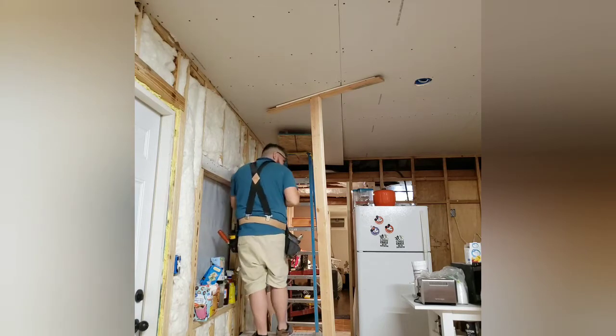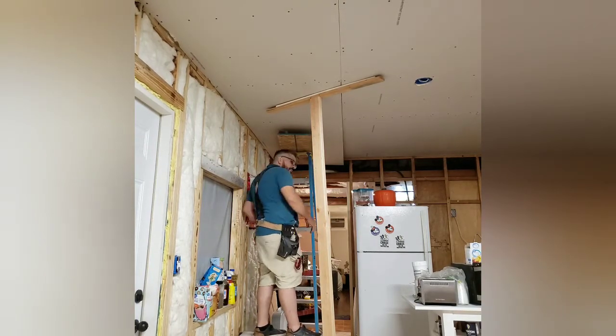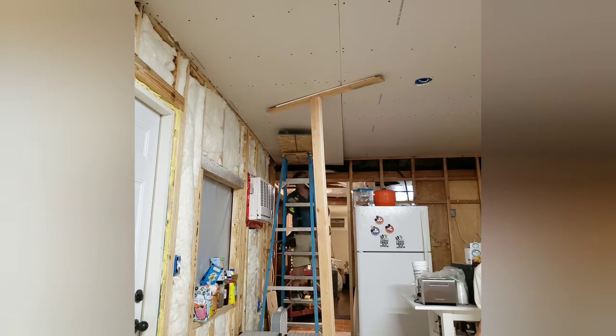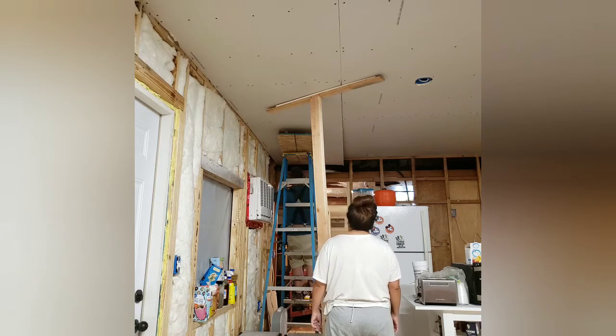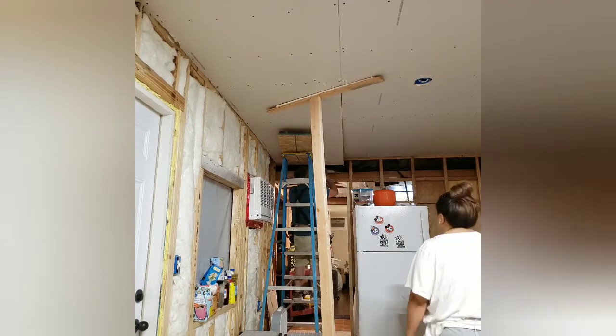We were going to wait until we mud to make those cuts. However, if you aren't a professional like us, when you're doing those holes and cuts you'll have a little bit of drywall that falls or cracks — and that just comes from not being experienced in cutting those holes for outlets and lights. We did end up having to tape and mud around those cuts. In the future I would say go ahead and do your cuts early, so when you have to mud, those little breakages from cutting will be much easier to deal with.